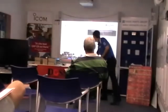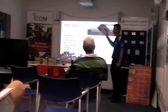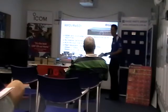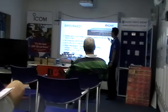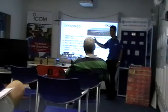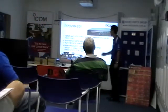Right, future of DOS, we're about done. So this is the SDI DVR we're talking about, or HD-SDI DVR coming out. I haven't even seen it, we've got five coming out as samples to trial. I apologise, I have not played with it, so HDMI VGA video output, 8 internal SATA hard drive ports, so if you're recording at 1080p, you'll be using up hard drive space very, very quickly, and it'll have a 4-channel HD-SDI 1080p video input with HDMI out.